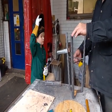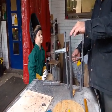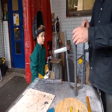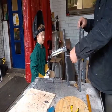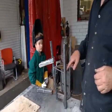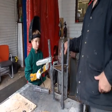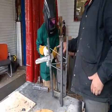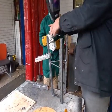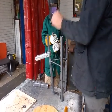These things are called stretchers in terms of furniture. You see this one's not in yet properly. So we need to tack all of these and tack them from the bottom. So a decent tack there, a decent tack there, decent tack there, there, there. So if we come up here at the top and we tack all of it. What was the trick I showed you about the rod? Because you're not this high, are you? You're that high. So if you want to get in here, you can do that.